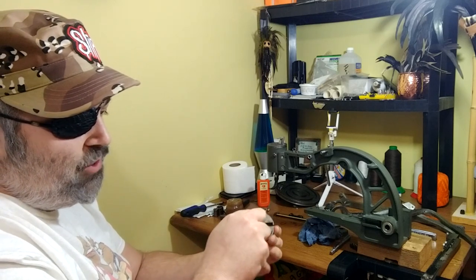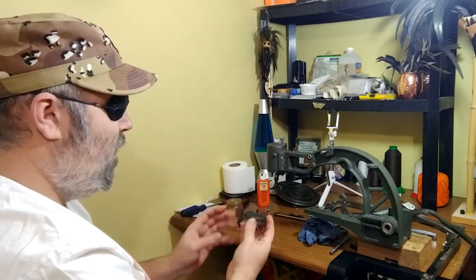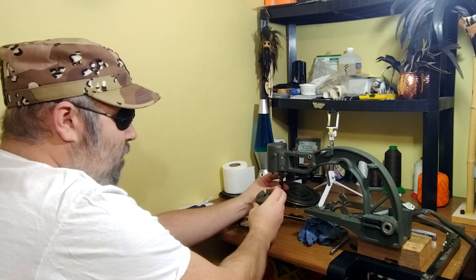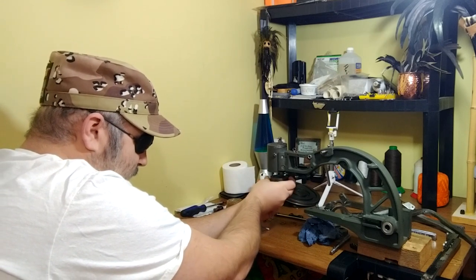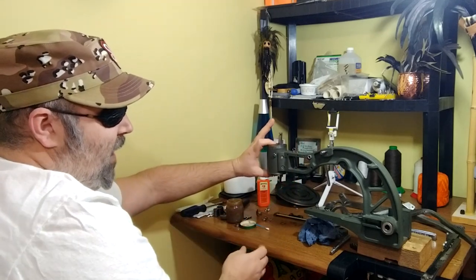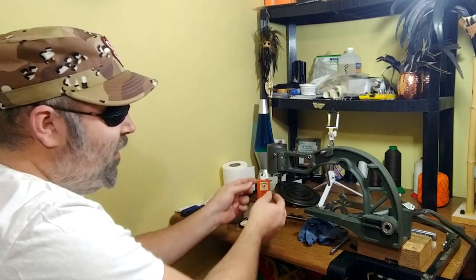I like to put a little bit of grease around the sewing head and also on the inside of this little round piece so that way when the sewing head spins around it's nice and smooth. Drop it into the sewing head — you can see it's not all the way set in there, but with it in place now we can use both hands. We're going to push back on the presser foot, lift up on the disc, and bring it down straight, and it'll just pop up a little on the back.